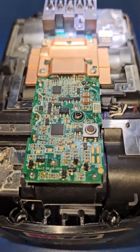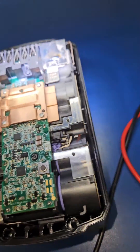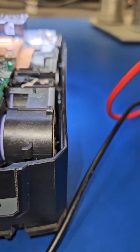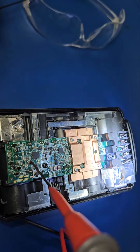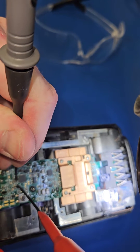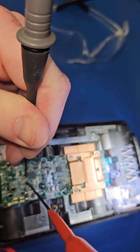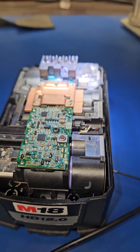I don't know if I can do it with both hands, but that's what I want to try to do. So pin 8 is power — I'll put that right there and see if I can do this. I've got 3.3 — 3.2703 is what it's showing. So the microcontroller is getting power, but when you command it, it's dead — no output. And we got it diagnosed from there.